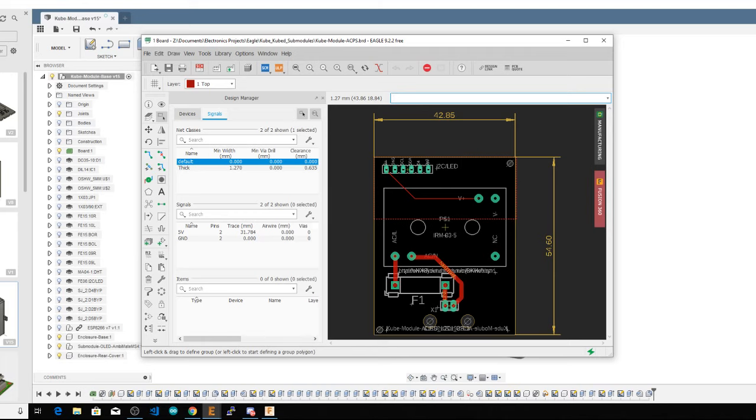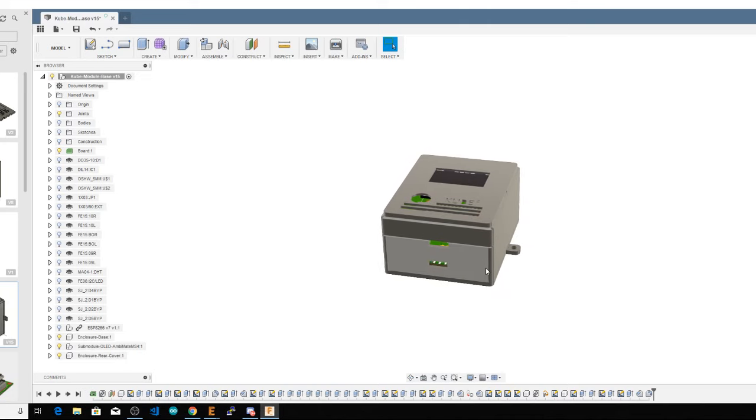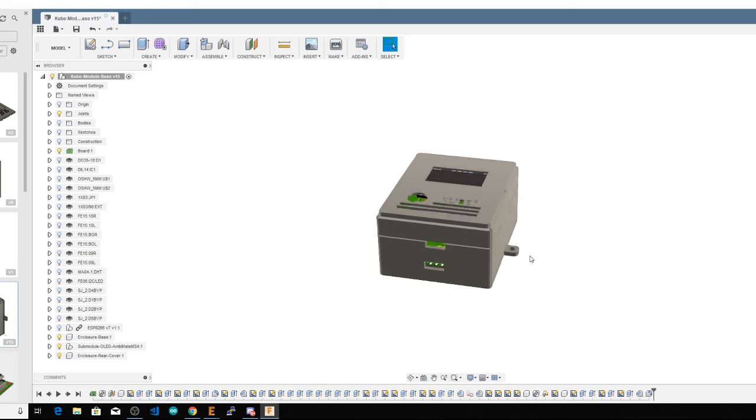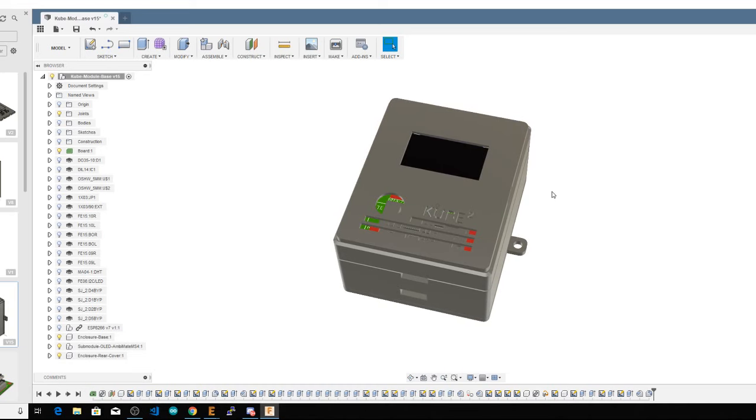This little sub-module would sit in the middle of the stack, between the OLED screen module and the base module — a sandwich of cube modules that perform a specific function. Because it's all over I²C, you can throw in other sub-modules too. I want to do one for the ADS1115 analog input module. The sky's the limit really — I²C is addressable serial so you can put different modules in there, and as long as the software handles it, that should be fine.